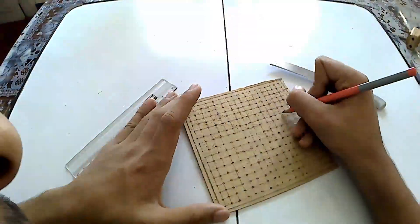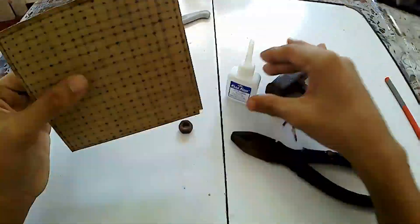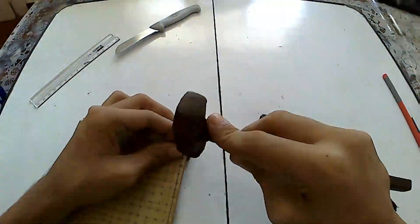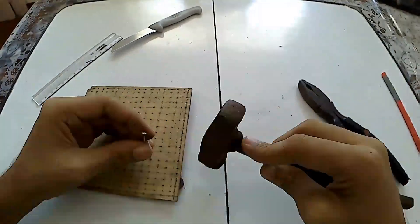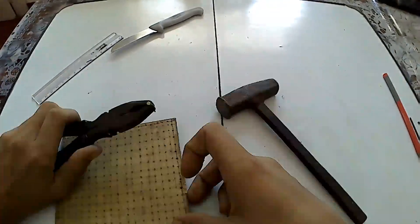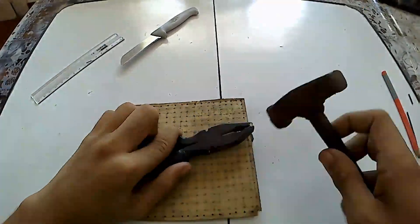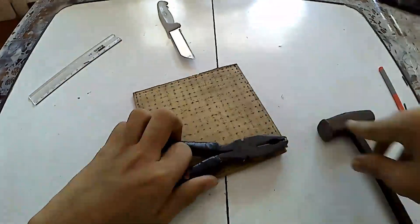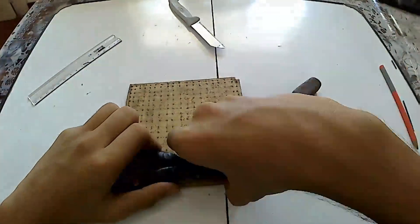So let's start building. I took a hard board as a base to place the cell. We have to poke holes for both graphite and aluminum. You can poke as many holes as you want — it's your choice. But for our cell, I decided to poke 190 holes after some calculation. Putting in the holes is a really tedious part of this project, but there's no other way.